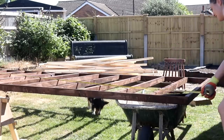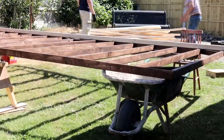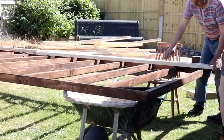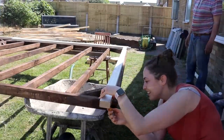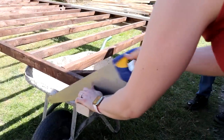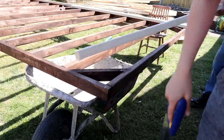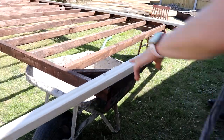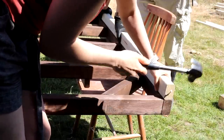We're starting off with the back of the shed. We placed a long structural piece of timber along the bottom, making sure it was dead level at one end. Temporarily placed another structural timber against the first one and another long ways, and drew underneath it where the end of the base lied. I marked P for pattern because that first cut I needed to match four times — because if you keep matching your next cut, you'll notice it probably gets bigger and bigger. After that, I started to nail the frame to the base to ensure it was square throughout.